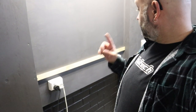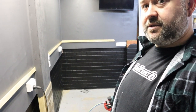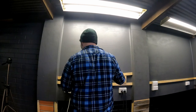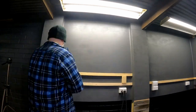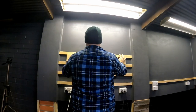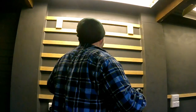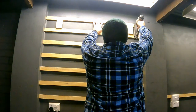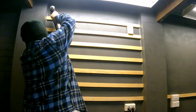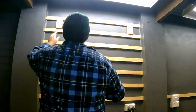Got the first row on - that should be pretty level; I used the laser and the spirit level. Pretty straightforward once you get the first one on and it's plumb and level - just use spacers. I used the spirit level there because the shed itself is a little crooked, so as I was putting them on they looked crooked but they were actually straight. The shed's on a bit of a downward slope to the left, but everything's 100% level and ready for the cleat system.